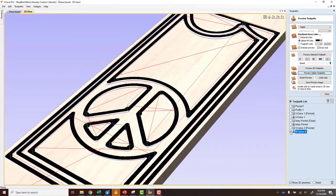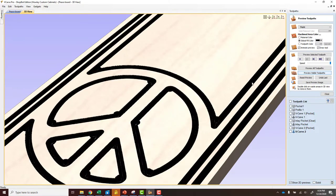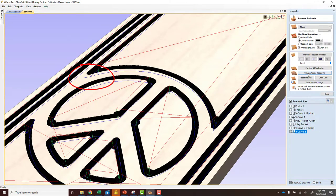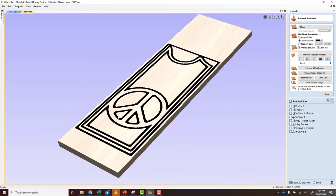However, if you compare that with the V-carve toolpath, the V-carve toolpath includes these little tails on the end. So if you look at the inlay toolpath, there's nothing there. The V-carve toolpath has this little tail on the end. And what that does is, again, if I preview this toolpath, we're left with little rounded corners. And the V-carve toolpath runs a little extra piece of the bit where it cuts out that rounded corner, and that's why it wouldn't fit. I didn't have those sharp corners, and honestly, if I was able to put the part back on the CNC machine and run it again, I could have fixed it, except that I'd already cut off the screw holes, and well, I'd also filled the other side with epoxy. So we'll just remember this for next time.